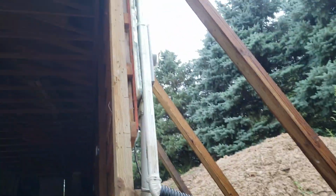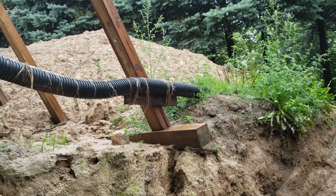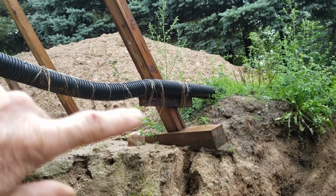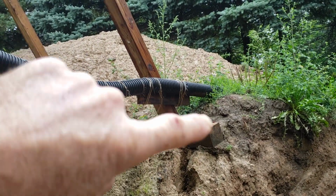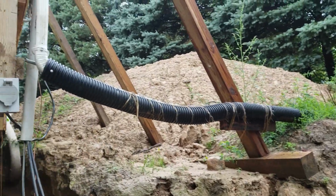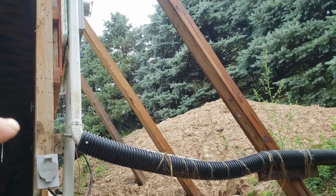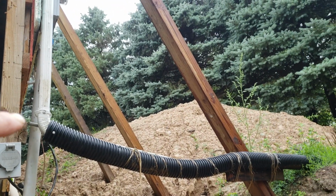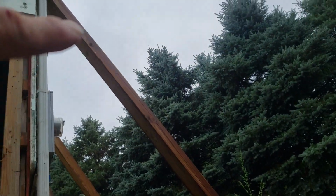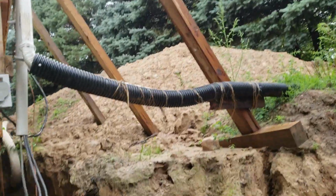All right, the corner of the pole barn is propped up. I use a 6x6 on the ground. I dug out the topsoil, put it on clay. I have clay. So that's like 16 feet across the ground. And I have 3 4x6s. But if you can use a 6x6, it's better. I just happen to have 4x6s. And this one at the corner has a stress fracture going all the way up. So it's cracked. So I decided I better get busy